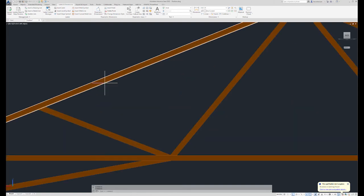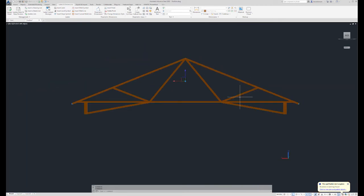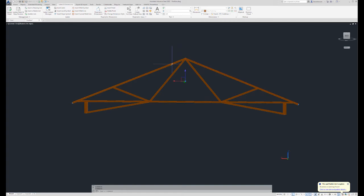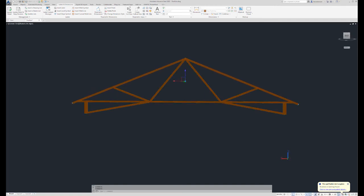That being said, I have to figure out on this odd shape what my primaries are going to be. And I think for me, I'd probably set the 2 top parts of the rafter or truss, and those would be my 2 primaries. I would set this with a digital protractor, and once I got that right, I would just have it clamped together with flat bars, no tacks involved. Then I would add the lower portion of the truss. These would be, I think, the 3 components that I could successfully start my shape with.